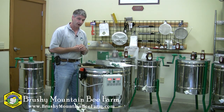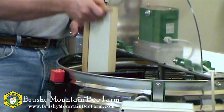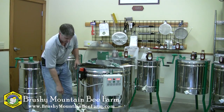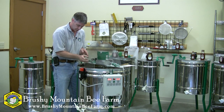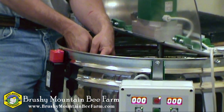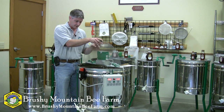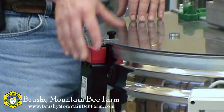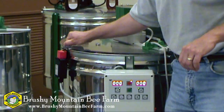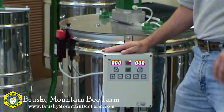I'm going to show you how this motorized extractor works because it does have a control box. I'll take these frames out real quick so my extractor isn't out of balance — I've got two baskets in there, so I'll load those in and load this third one in so everything's balanced and it doesn't walk around on me. There are holes in the extractor basket that those metal baskets fit into. You'll notice now that this is locked and can't be opened. I'll go ahead and turn on my control panel.